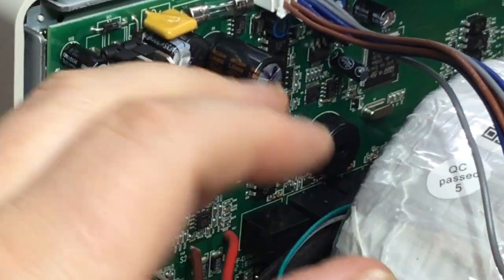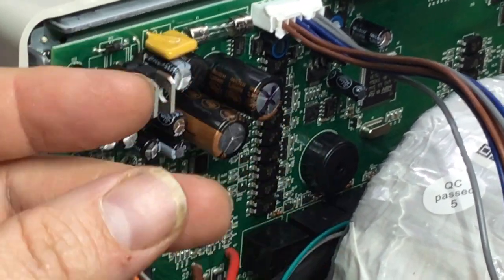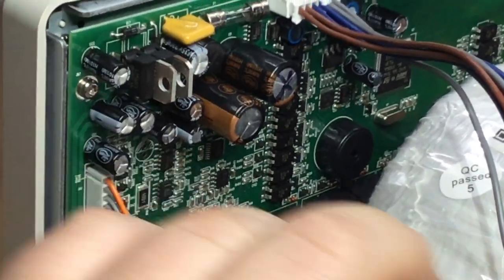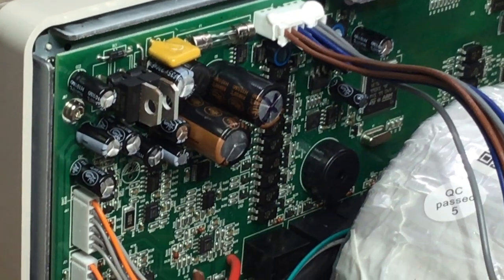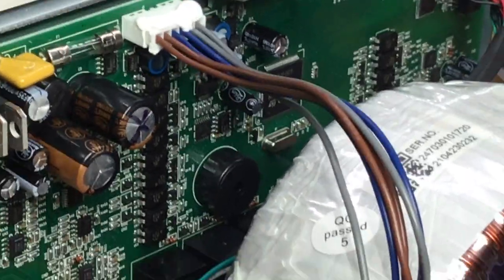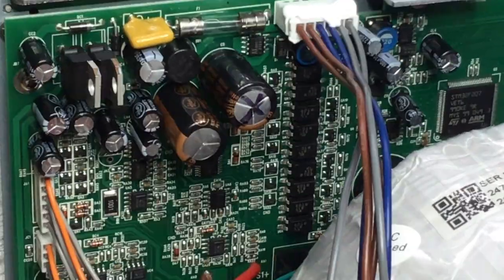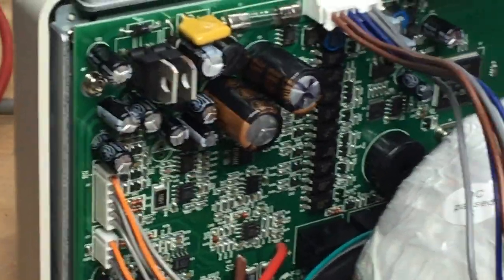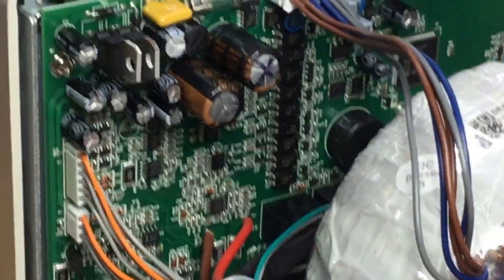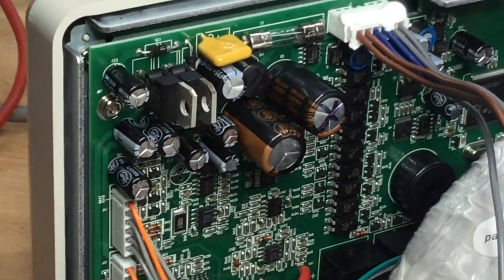like explode out, and all the capacitor foil unravels, and then all the wax paper and it's like a cottony substance, it goes all over the place and it stinks vile. So fortunately we haven't got that bad at the moment with it, but there are one or two other capacitors that I suspect may also be failing, them being the same brand. I'll be looking out for some of the telltale signs that other capacitors may have failed. So while I've got the board off, I'll desolder these capacitors and see whether they too are failing.